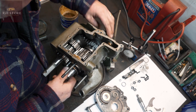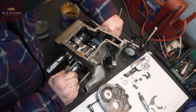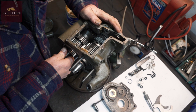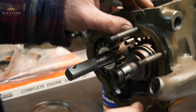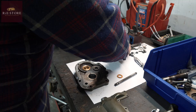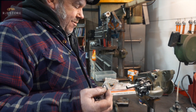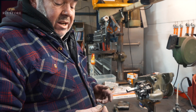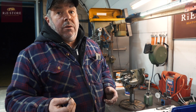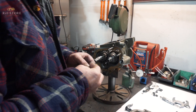Push him over there — that's neutral. Him over there — that's neutral. So you should be able to turn it all. That's your engine running — well, that's your rear wheel, that's your engine running. I can hold the rear wheel, it's not turning, so you know it's in neutral. Now you've got a locating stud base there — you want to make sure he's pushed on there properly.